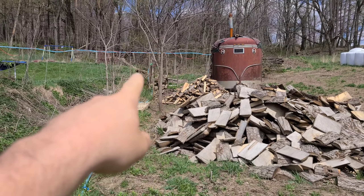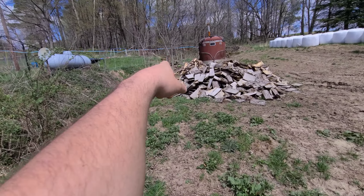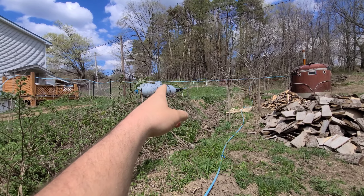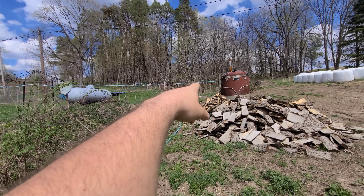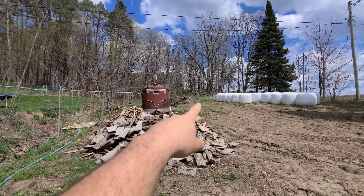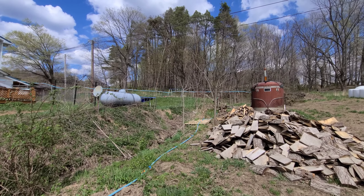Right there at that post is where both lines meet. So ideally, once this is full, it'll start pushing it back up. The current plan is start at the top, chase it down. If it starts traveling up the laterals, plug them off at the ends that we just opened. Then we'll follow it all the way down here. Once it starts working it back up, there are a few spots we'll have to plug because theirs are much lower. The next one's clear up there — we might have to run back and forth chasing it up the laterals. Let's go check the tank.